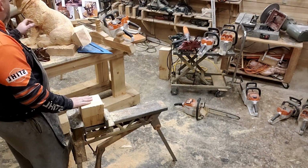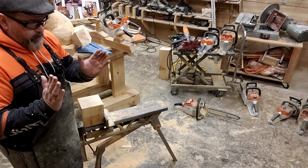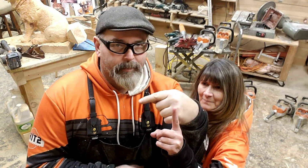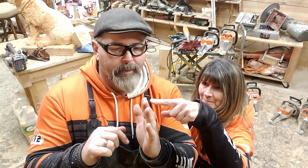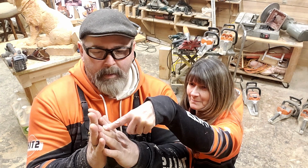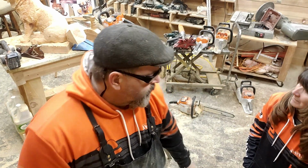This piece over here, no matter how flat you can make the two pieces, if you can't screw them together or clamp them together with that nice centering pressure, you won't make a flat on flat contact. So here, Pam, bring your finger over here. Just go like this and point it at my hand. If you put it right in the center and push in, it goes flat straight in. But if you go up to the top and then angle it downward, it has a tendency of moving things down and also opening things up on the bottom. You know what I'm saying? And so by the time you get that screw in and you get like 3 screws in and you can see it's still got a gap, that's what happened on that.